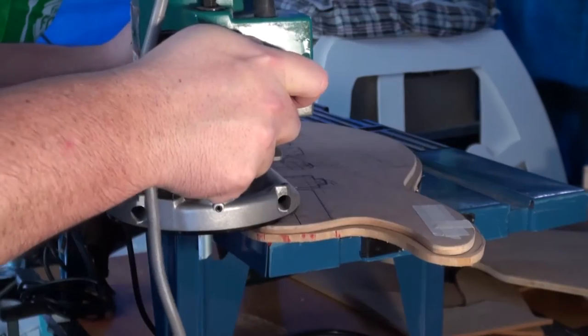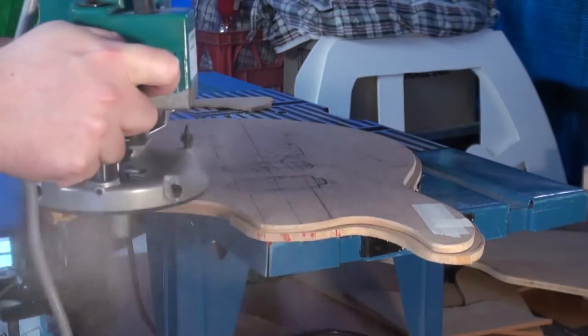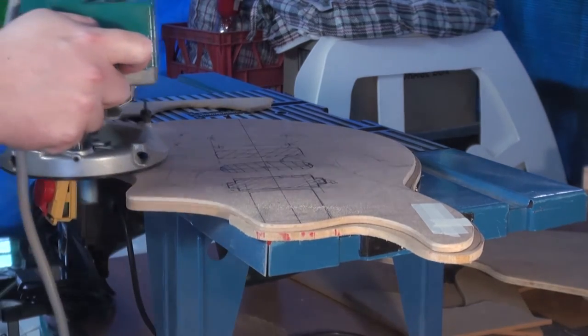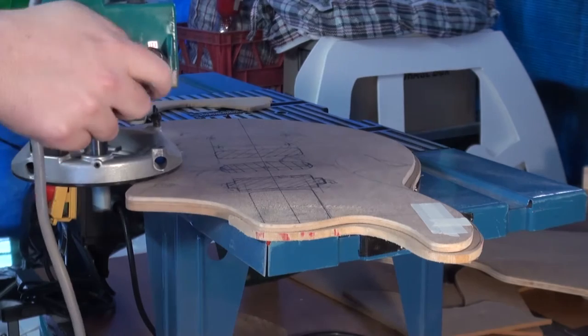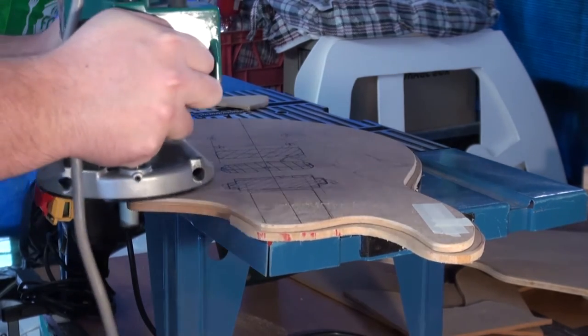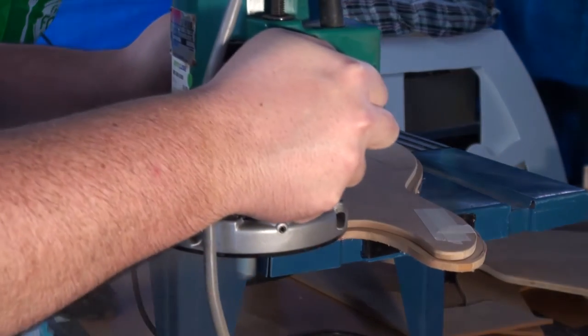The main rules I applied was to use templates, to jigsaw the body, as I don't have access to a bandsaw, and route the edges to the template with a flush trim bit. This is actually one of the first things I had used my new second-hand router for.